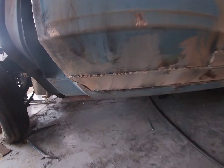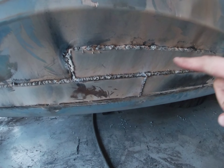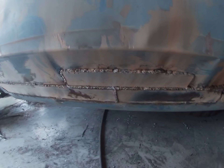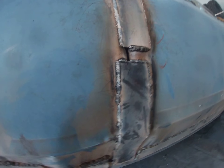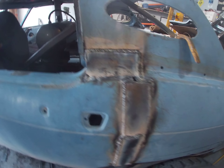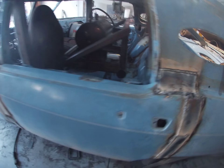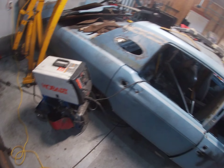Driver's side complete — got that whole bottom welded. I had to put an additional piece of strap in there because there was such a huge gap, but that's okay, this is the driver's side so we're allowed to reinforce — it should still keep me legal. There's a little gap in the middle there but I was just trying to get rid of a couple pieces that were just weird sizes. Got a nice piece across the bottom there, a nice piece here, and then used this piece. There was a door gap there that I took care of. So now we'll get started on the passenger side.